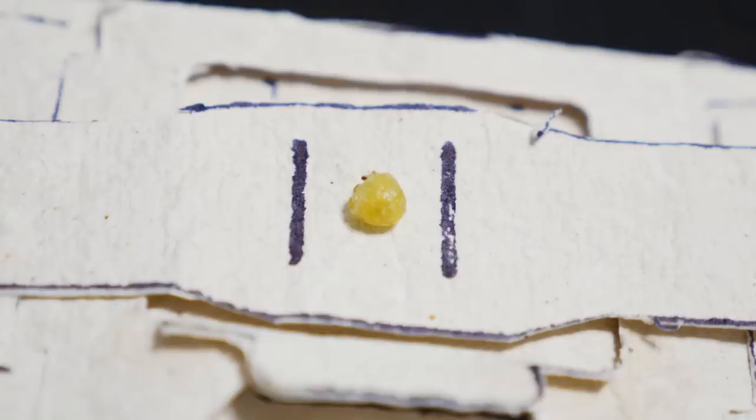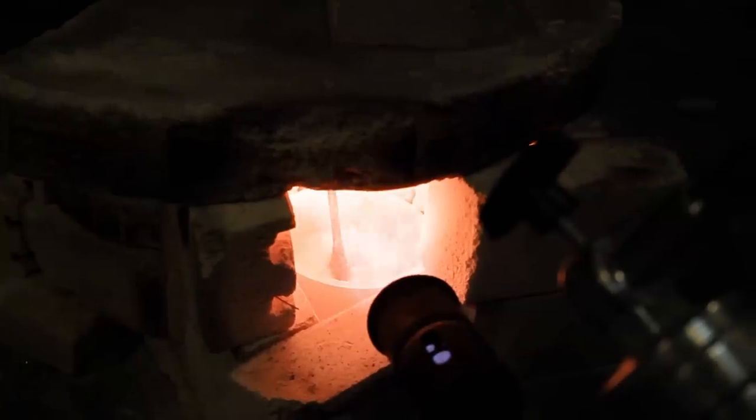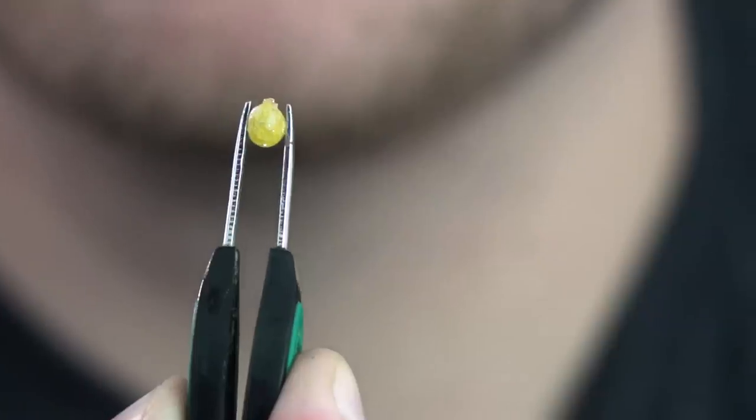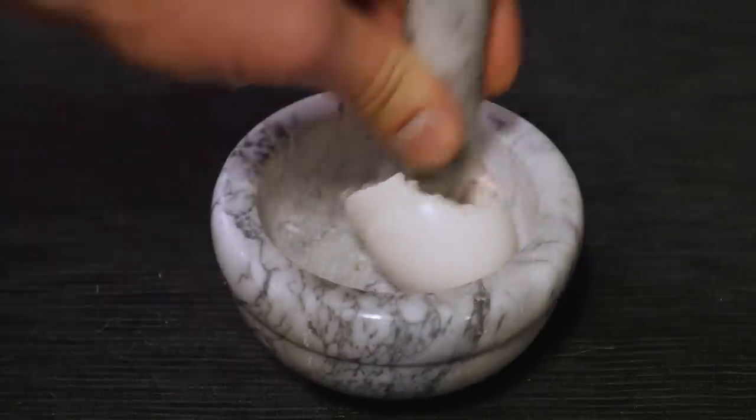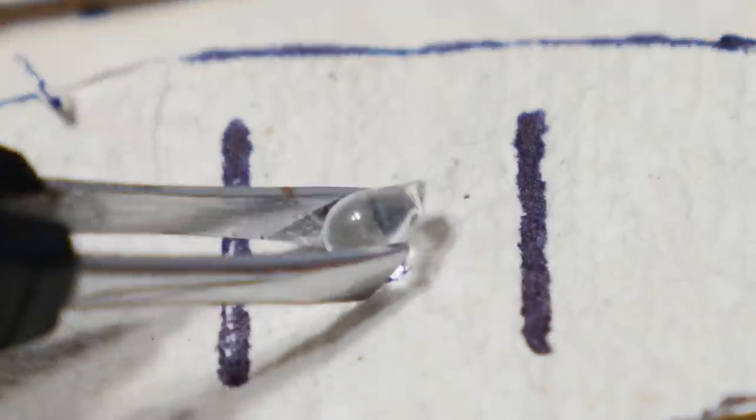So yeah, that's completely opaque. In the end, this attempt at making glass was not any more successful than my last, unfortunately. The biggest culprit I suspect was the kiln itself — I think if we could have baked it hotter and for longer, we would have gotten a much better result. It's also developed a yellow tint, which may be from trace amounts of sulfur in the eggshells, which can cause yellow-tinted glass. So despite all of this, I still haven't managed to make good glass from scratch. However, with the glass rods, I was actually able to make pretty good lenses.